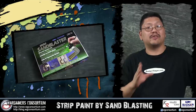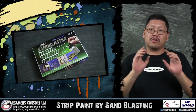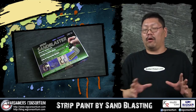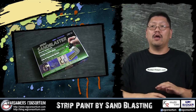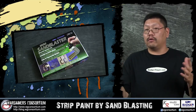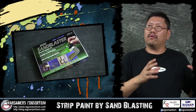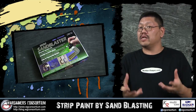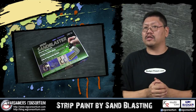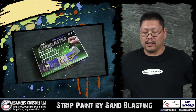And that's it guys — the Badger Mini Sandblaster. This is a really cool product and there are probably other uses for it, but let's go over some quick things. First of all, you need a mask — this thing gets all over the place. The aluminum oxide will get on your desk and everything. Shoot in a box so you can capture and reuse it. If you run out of aluminum oxide, you can replace it with baking soda, so you don't have to spend money on another bottle.